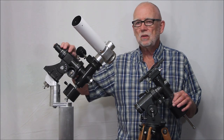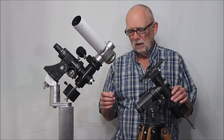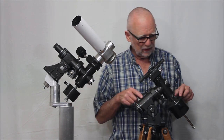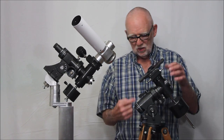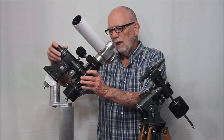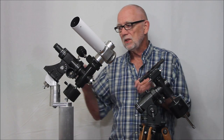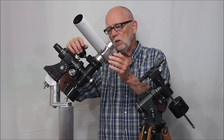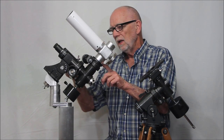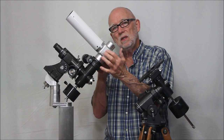Let me show you where this Coudé telescope came from. The mount is basically a more or less generic mount from the 80s or 90s. This is almost identical to it — the castings are almost identical; it has an Orion name on it. If you compare them, you can see this is the same as that but sort of inverted. I had to monkey around with this thing to make it able to clear. I thought seriously about mounting it in an upright fashion, but then you'd have yet another reflection. The main problem was the focal length — the actual objective is right about in here, so you've got that much focal length. This thing has to have so much focal length, and if you shrink that distance, this becomes much more constrained.